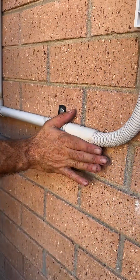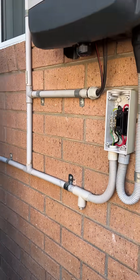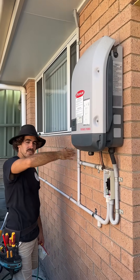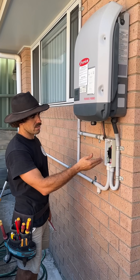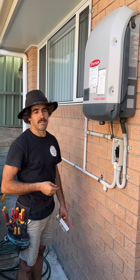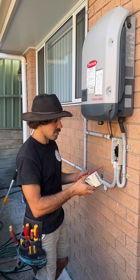Before, it just used to go like that, and we put this little thing in here. If you follow from here, this is coming from the roof — water comes down here because the penetration hasn't been sealed properly. It comes in here and it can go into isolators, especially if it's on the DC side, and if you mix water with DC or electricity, typically that's not good.